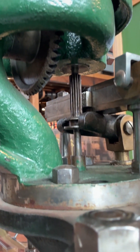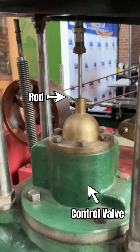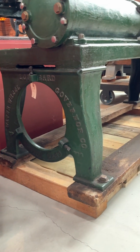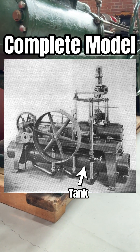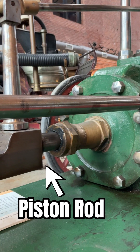If the turbine runs over that speed, the fly balls drop a rod into the control valve, which directs hydraulic oil from the tank — which is missing from ours — to the cap end of the operating cylinder, which pushes the piston forward.